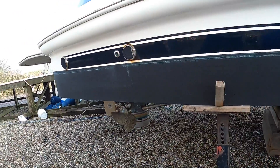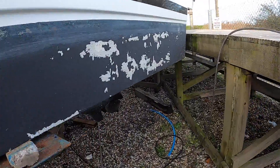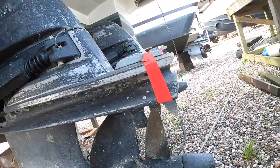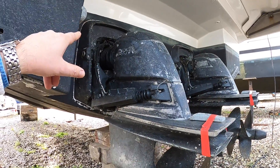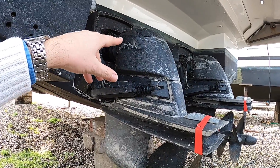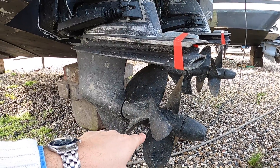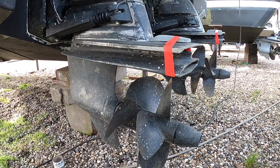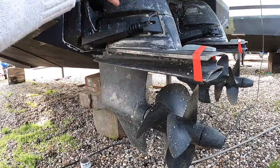Next I'm going to show you an outdrive, also known as a stern drive or inboard outboard. These are Volvo Pentas, and the engines are right at the back of the boat; the drive comes out of the back — just on the other side of that bulkhead. These units are effectively the gearbox, and then the drive comes out and down. These are what's called duoprops — they don't all have duoprops but we normally specify them. With a duoprop the props counter-rotate, going in opposite directions, which gives a bit more grip and efficiency.